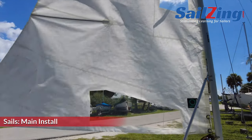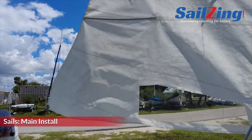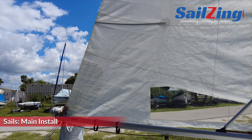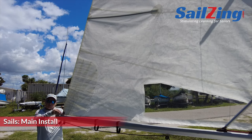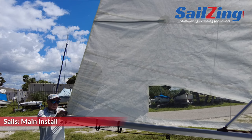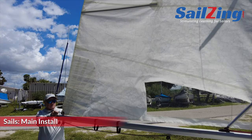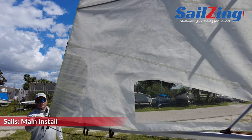And then in the back, to run the tack, you've got another lozenge and another slot here. So you basically just run this in, and then I like to attach my outhaul again with a soft shackle. I like to keep the weight down on the ends of the boat especially, but anytime I can avoid using hardware, I try to do it. But certainly you could be using just a regular shackle back here. One recommendation was just tie the outhaul directly to the grommet and just come straight back to this block. I kind of like that it runs through this little eye, and that's how my outhaul operates. So that's how you install the mainsail.